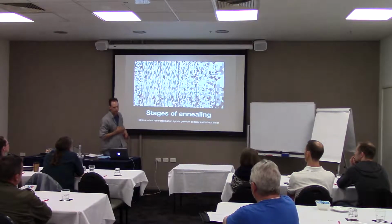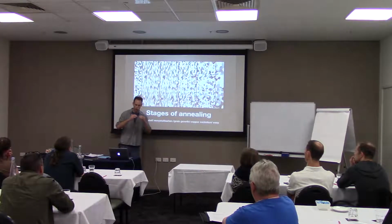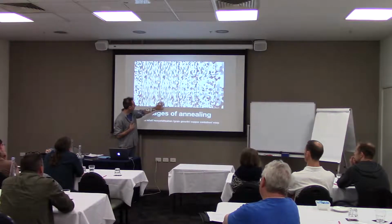Good, there we go. And all of a sudden what's happening at this point, this has been cold worked, and then at this point, each one of those little edges that have strain on them form a new nucleus. And then you've got electrons flying around, and they rebond and form a new grain. So now we've got all of this grain.